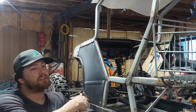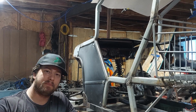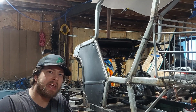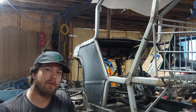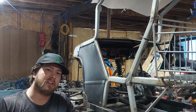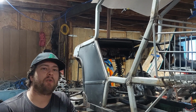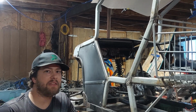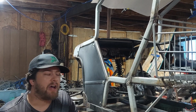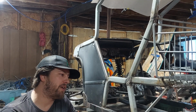So I'm going to take that motor, strip it off the mini bike. We're going to take the tank off, take the carburetor off, the exhaust, just kind of de-dress it a bit and get it ready to be used for mock-up on this rear swing arm. We won't be modding the engine in this episode. I'm just going to be using it for mock-up purposes, just to make sure that when it's on the swing arm and the suspension is coming up and down, twisting and articulating and doing all the suspension-y stuff, that motor is not going to make contact with the frame. And also that if we have to do anything to the motor, we can get in there. The pull start's not blocked by anything. It's not in the way of the suspension and all that stuff. So I'm going to go pull that off the mini bike, and then I'm going to start stripping it down and getting it ready to put on this swing arm.